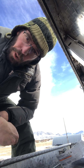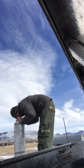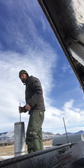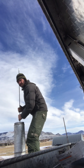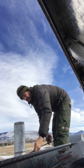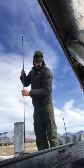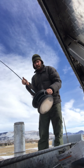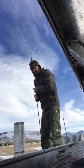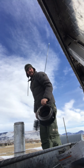I went and grabbed my flashlight, so I'm going to take a look at this real quick before I pull the brush back up. It looks nice and clean to me. So the next thing you've got to do, once you get it all the way down and really clean, is pull it all back up. Watch your head when it comes out. Once you're done with that, go ahead and take your top — you can clean it out with the brush too. Just stick it in there and give it a little shake. I like to set it on the roof, pinch it with my feet, give it a good brush, then pull it back out and give it a shake.